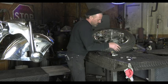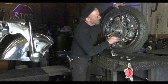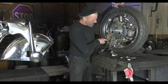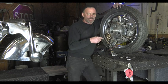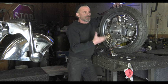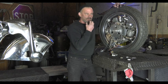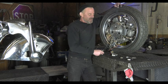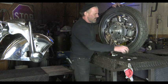You can see with a lot of this stuff things only just clear everything — it only just clears all the way around the rim, these only just clear everything. That was the thing when you're building an engine in the front wheel: you've only got so much real estate. I was so worried about the electric start because there's only a small electric motor, and if I'd had to go bigger I would have been screwed.